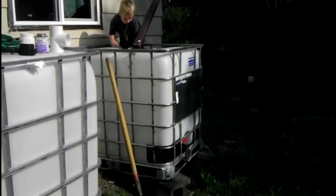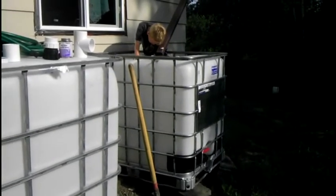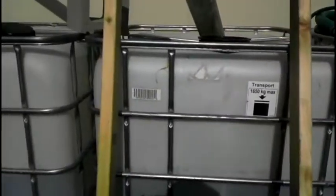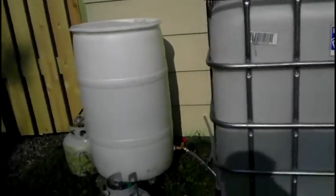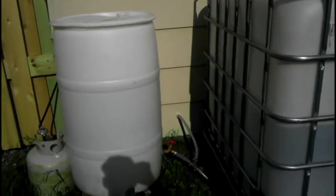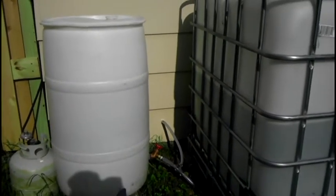There's my stock tank checker. Now, when this one gets full — there's obviously a little imbalance until it's hooked up to the plumbing — we have a 12-volt fluid transfer pump that we put in there and pump the water out into these tanks. When they're full, we have a 55-gallon rain barrel here, and I open that up down here so this tank will balance with the other tanks.